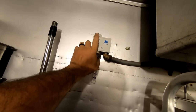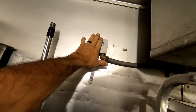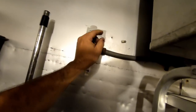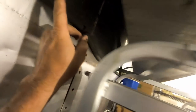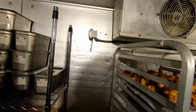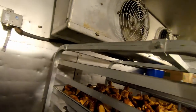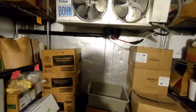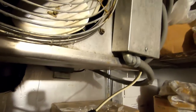The big thing here is I talked to the owner and told him what I want to do — I don't want them to think we're trying to sell them a bill of goods. This came on about 45 degrees. As slow as this thing is to get where you want it, we're going to run it for a bit, set it up around 38 degrees, and see whether it's accurate. This should start cooling down now. The coil looks clean and clear. We could probably put a solenoid back at the unit since we're only about 30 feet away, and then we could pump it down. Freezer's been down for a while according to the customer. It sounds like it might be stuck in defrost, because as I mentioned that clock has not moved since I marked it.